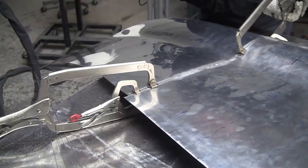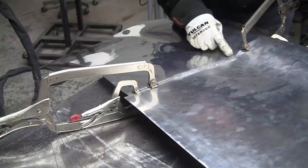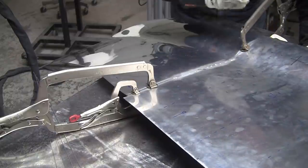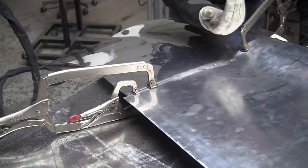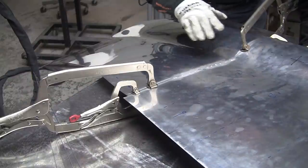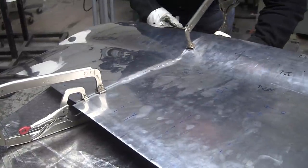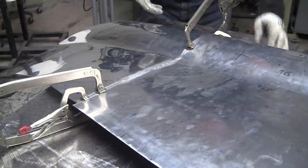We'll come up the hill a little bit. I'm a little off alignment right here, so I might have to go get a hammer. I need one of my body hammers that has a round face on it in one direction, not a convex face, but a radiused face like this. So I'll get one and put a dolly under there and get that straightened out. This is all good over here. So let me go get the hammer and dolly.